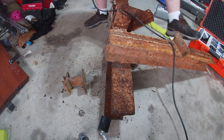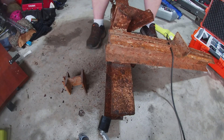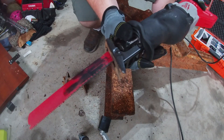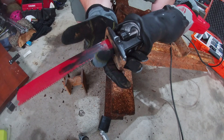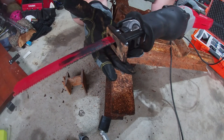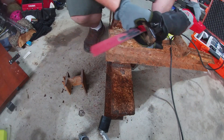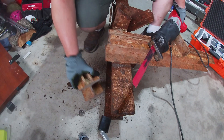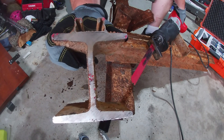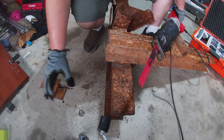Not bad — that took about 45 seconds to go through the I-beam with no issues. As you can see, the teeth are still fine. We're going to do one more cut here just to verify. I've seen advertisements claiming the blades don't get that hot, but I believe that may only be true for the circular saw blade, because the reciprocating blade definitely got hot.